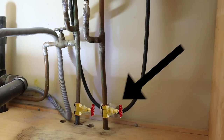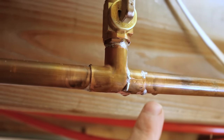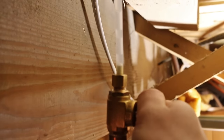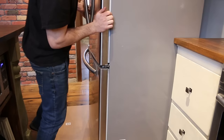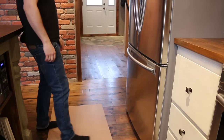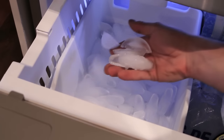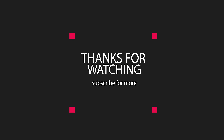With the refrigerator out of its hole, go ahead and proceed to testing. Slowly open up the shutoff valve if you used the under-counter method, or in my case the main water valve, and verify there aren't any leaks on the main water line. Then open up the valve for the fridge connection and do the same thing — inspect all the connections you made to make sure there aren't any small leaks. Once you're satisfied, slowly push the fridge back into its place and wait a few hours to check if any ice cubes were made. And yes, it works perfectly! Time for a nice refreshing drink after all that work. That completes the installation of a water line to your fridge. If you enjoyed this tutorial, please give it a thumbs up and share it with your friends. Until the next one, thanks for watching!